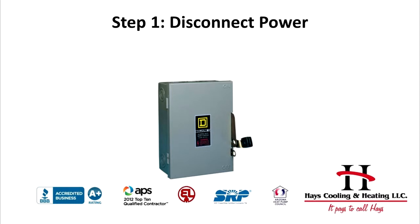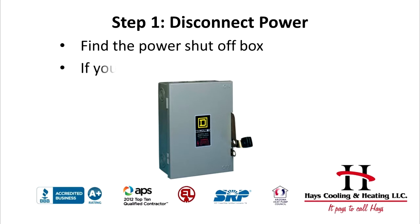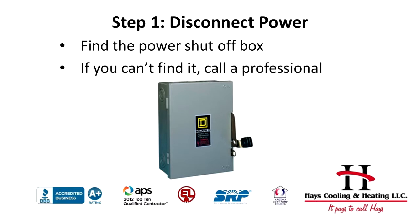Step 1. Disconnect power to the HVAC unit. Most central AC units have a power shutoff box located near the unit. Before you take apart anything, make sure you shut power off to the system. If you can't find the shutoff box to your AC system, don't take the risk. Contact a professional HVAC contractor just to be on the safe side.